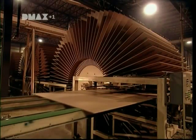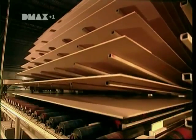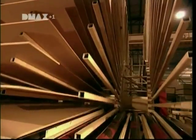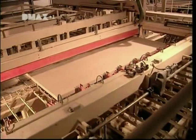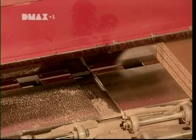They're still hot from the hot press, so they're put aside to cool for about half an hour. Once the masterboards are cool, they're sanded. Then a stacking machine piles them about 80 sheets high. A saw then cuts them into smaller, more manageable sizes to be sent off for construction.